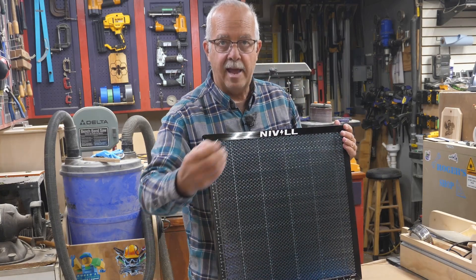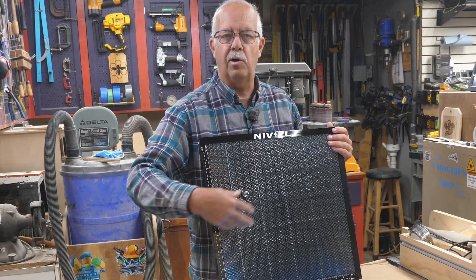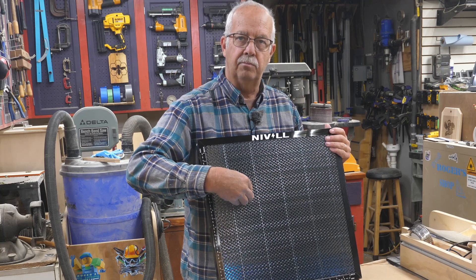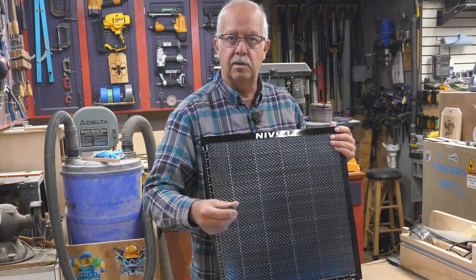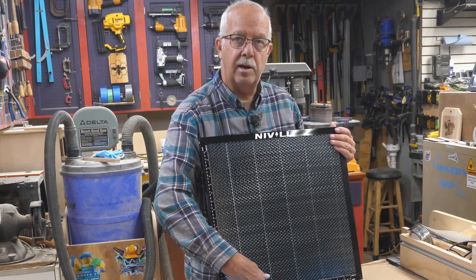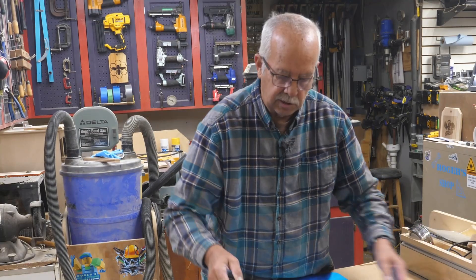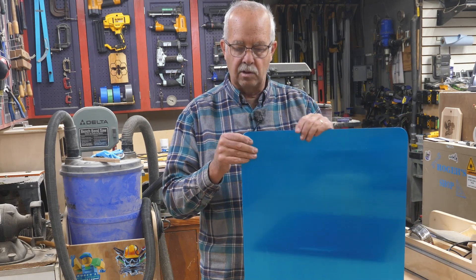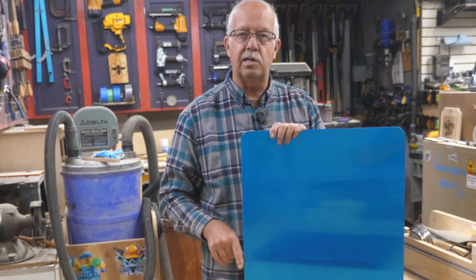What all comes with this: you get some little magnets here to hold your work in place. If you're doing fabric you may need to hold it down; if you're doing very thin or very small wood pieces, you want to put them around the border to keep it from shifting. This is marked in both inches and millimeters in both X and Y directions depending on which way you set it on your laser. There is a protective sheet underneath — aluminum — and it has a blue protective film. You definitely want to peel that off, because if you're cutting and the laser beam hits it and starts smoking, it's going to stink.